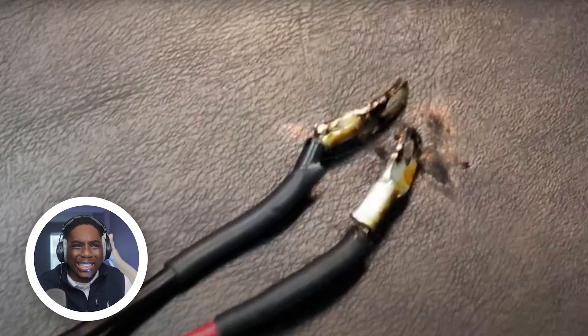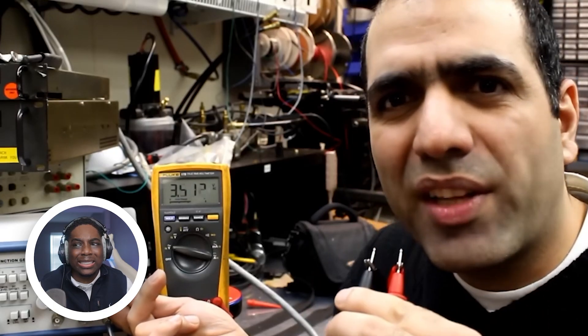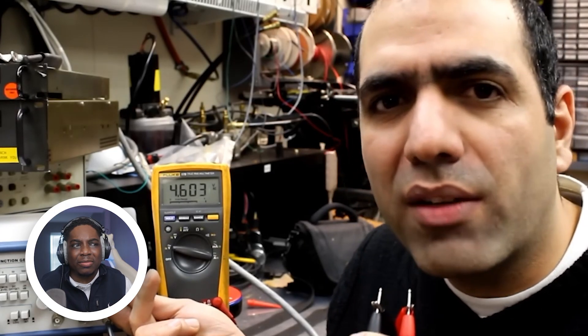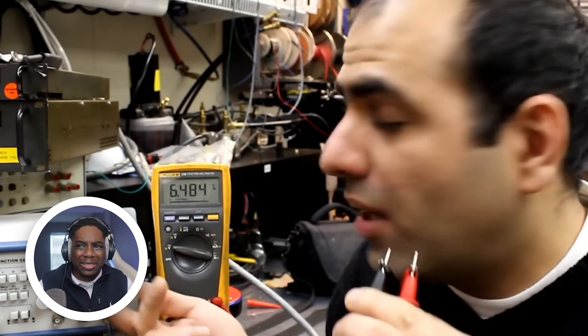He can do this too! Now reducing voltage and increasing frequency all the way to 60 Hz. AC test: at one volt he can definitely feel it. At three and a half volts it's quite annoying. At four and a half volts it's torture. He can't go over six and a half volts. Conclusion: AC hurts at RMS levels roughly half of the equivalent DC level. Anything for science!